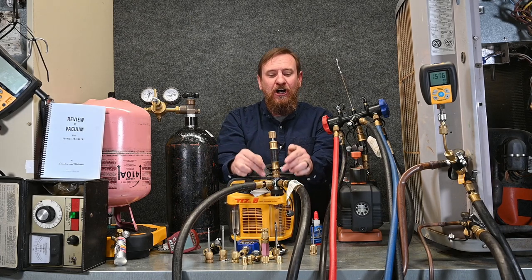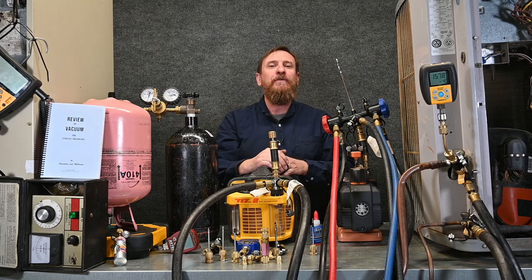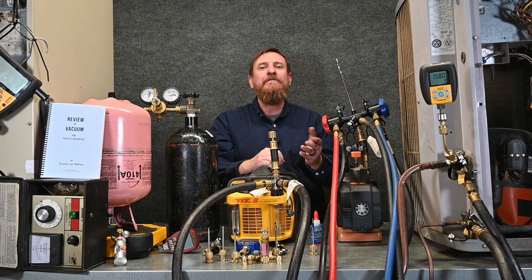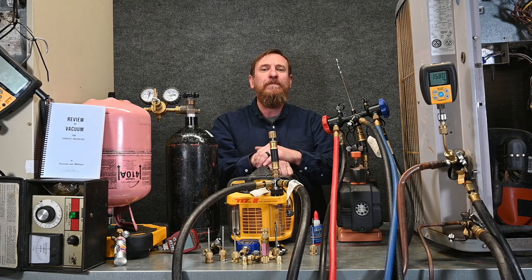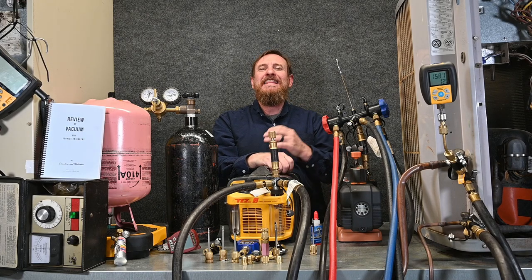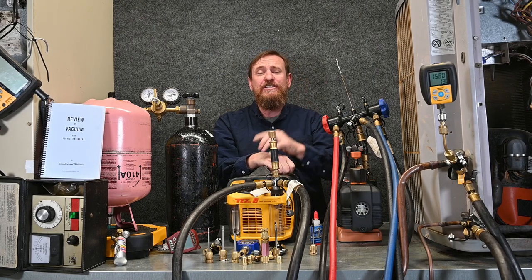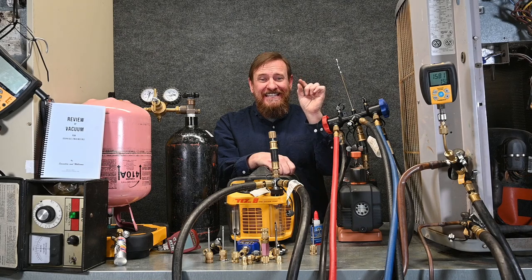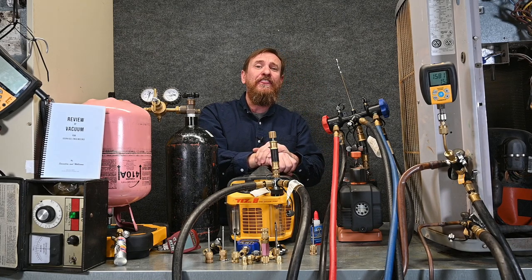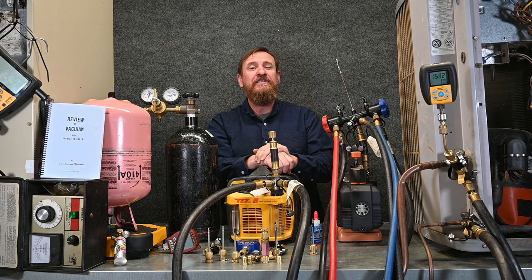So now you're pulling through the big hoses, all your connections are sealed up really well, your valve cores are removed, and you're able to pull a vacuum nice and quickly. Now for pulling a vacuum, we need to be able to measure our vacuum — if we're not measuring, we are completely guessing. The analog gauge set and people looking at 29 inches of vacuum — that's not enough. There are 25,400 microns in one inch of mercury, so even if you could see that much of the needle, that needle is not going to be nearly as accurate. You could be showing 30 inches of mercury and still have 25,400 microns in there.